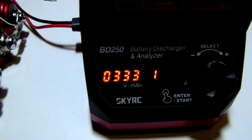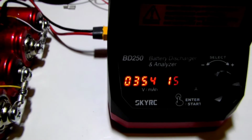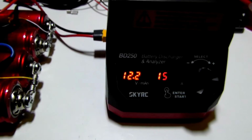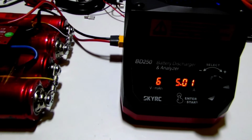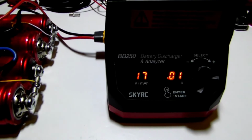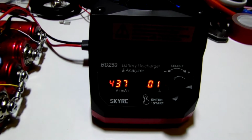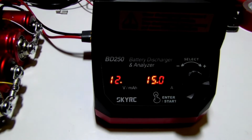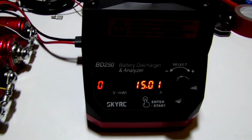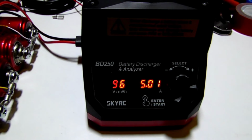Anyway, I need to find a good reliable source for BMS because I'm always building batteries, but it's hard to find a good one. I actually have found a good one, don't even know what brand it is. It's unbranded, a 100 amp BMS that's actually pretty good. I use it in my 220 amp hour lithium iron phosphate battery, and I've pulled over 100 amps off of it, and it's been fine.